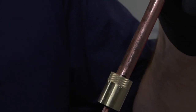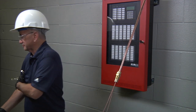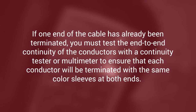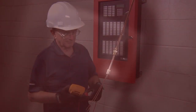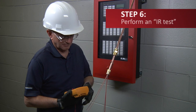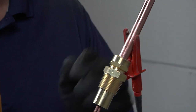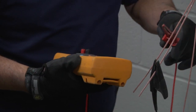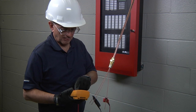Finally, check the pot. The back of the pot should align with the mark made previously on the copper sheath — in our case seven-sixteenths of an inch for the three-quarter inch pot. If one end of the cable has already been terminated, you must test the end-to-end continuity of the conductors with a continuity tester or multimeter to ensure that each conductor will be terminated with the same color sleeves at both ends. Watch our supporting video, Continuity Test, for the detailed procedure. Next, you must perform an insulation resistance test using a megohmmeter set to 500 volts DC to check the insulation resistance of the cable between the conductors and the sheath, and from conductor to conductor, to ensure that they are free of grounds and shorts. The other cable end must be terminated and sealed, or a low IR reading will result.